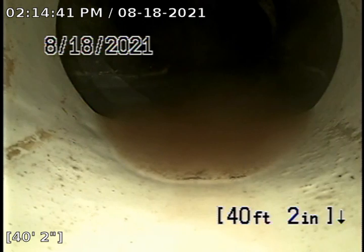The total length of this pipe is 40 feet long. The SDR plastic section is 22 feet long. I didn't see any roots, breaks, or any issues in this line — sewer is in good condition. We're going to end the recording here.